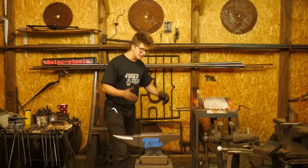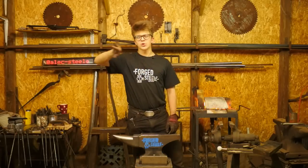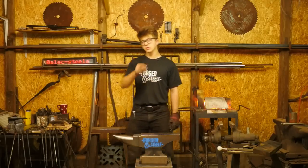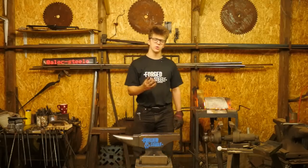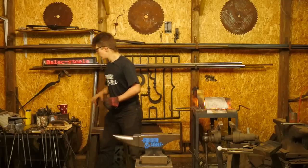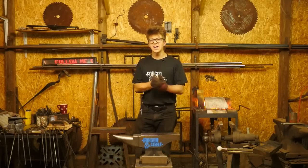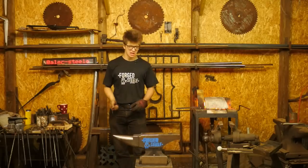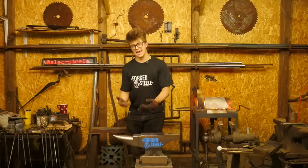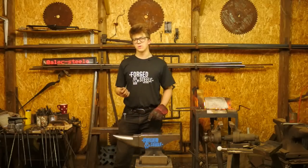Hey, Billy Nagel, great to hear your comment. Billy is asking me, he's aware that I heat treat some of my tools, but I also don't heat treat a lot of my tools. The tools that I will heat treat are the tools that I'm going to use to be striking things at colder temperatures. For example, most of my hand tools are heat treated. This is so that they have a greater toughness when I take a piece of steel at the lower temperatures, as you've seen me do many times, and lay it out with small taps and then progressively harder hits. If it was left as forged, it would not be able to withstand that.